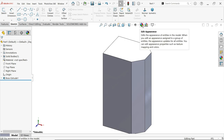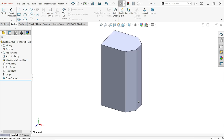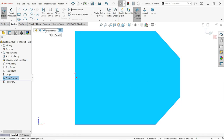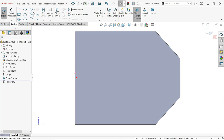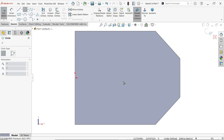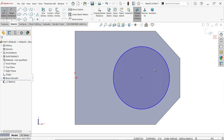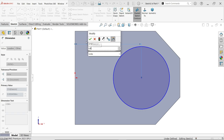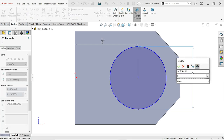Now let's change the appearance — we will change it later. Select the back side face and start a sketch. Activate the circle tool (not perimeter) and draw one circle here. Press Escape to exit. Apply Smart Dimension — the distance is three by eight inch. The diameter is also three by eight inch.